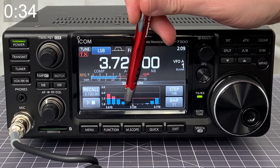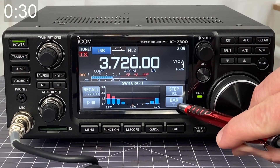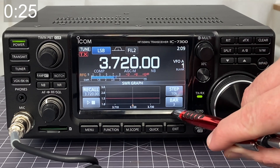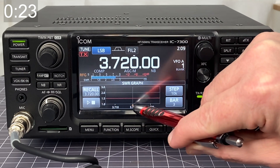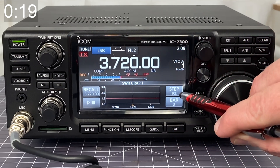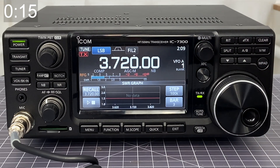These steps across the bottom are indicated by these bars here. I have 11 bars set up — 11 increments. I can change that by either increasing or decreasing, and likewise I could change the steps between the bars by changing the step size: 10 kilohertz, 50 kilohertz, 100 kilohertz, etc. So you can get either a larger, wider swath or a smaller segment of the entire band by changing those settings.